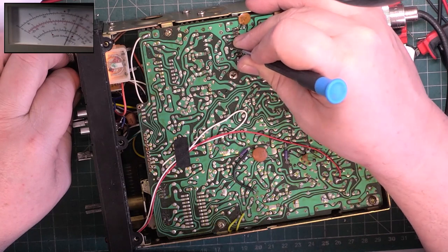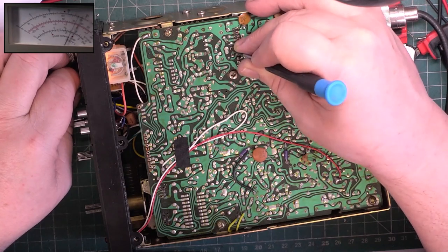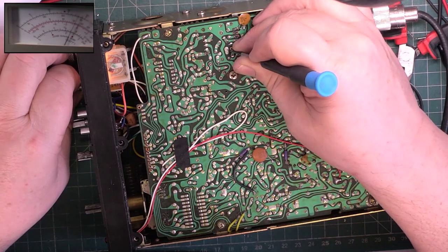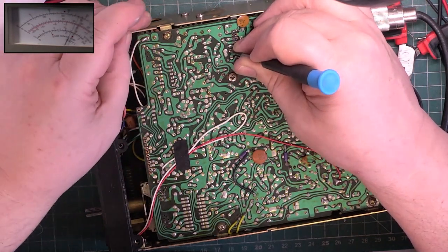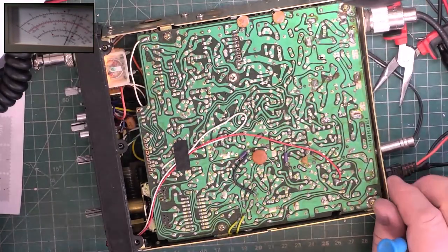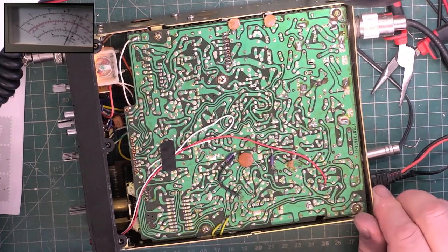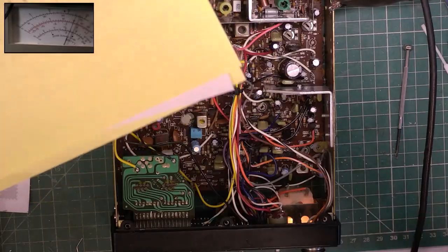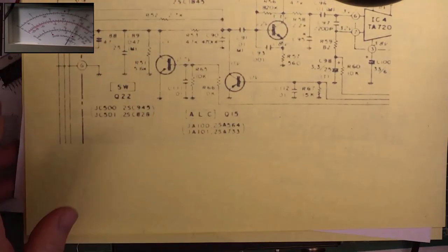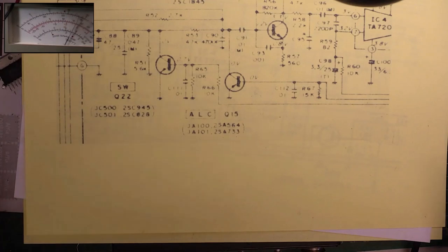When I come to check, we've got a bit of audio on PA, and we've got a bit of audio being transmitted. And if you wind the deviation right up, you can actually make it about as loud as a new radio, but not as loud as it should be. I think we were able to get something like 1.4 kilohertz deviation with the deviation at 4, but it's clearly not right. So finally, we get to the root of the problem. So now, of course, have the capacitors killed this? Is it a power mic that's been wrongly connected that's killed it?